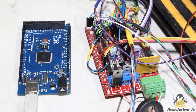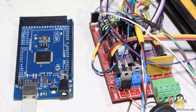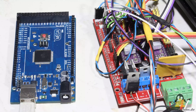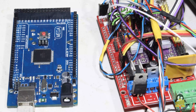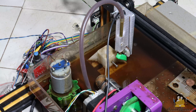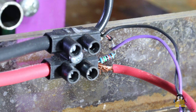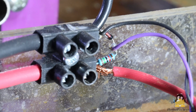When it comes to electronics, in addition to the welding inverter, I use an Arduino MEGA with an attached RAMPS board version 1.4. Both components are widely available and easy to source. An old computer power supply provides the 12V for these components and the stepper motors. The water pump is 3D printed, with a drive motor sourced from an old inkjet printer. As feedback from the welding inverter, only the output voltage is measured via a 3V Zener diode with a 15kΩ series resistor.